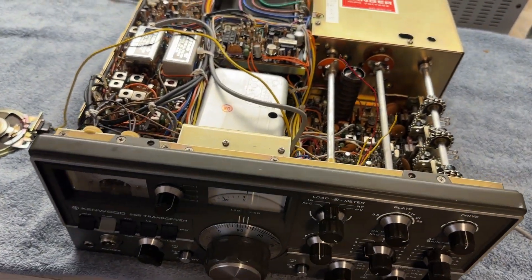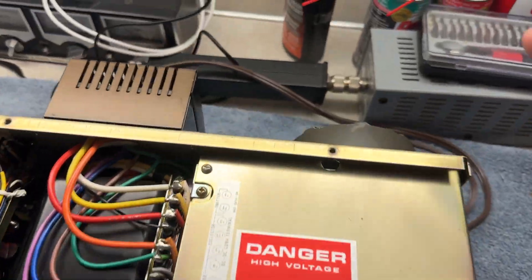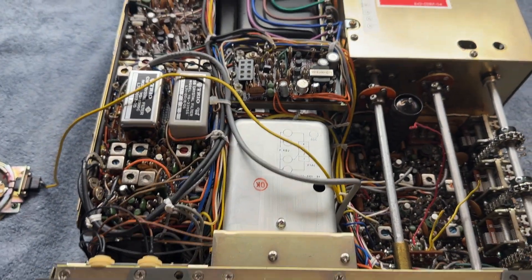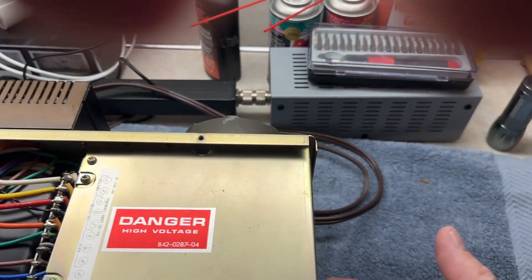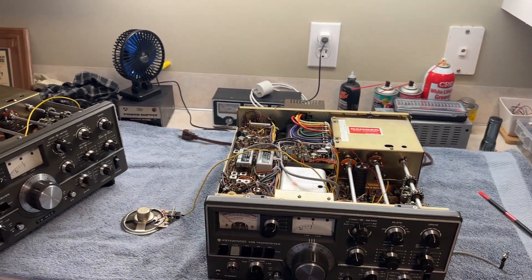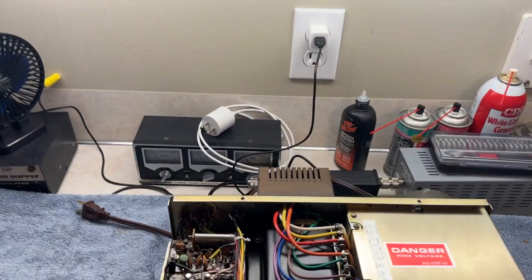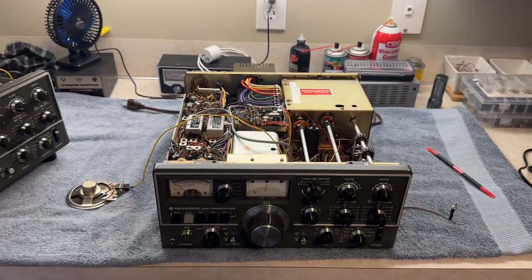Then, having done all that, go ahead and turn this off, unplug it, turn everything off, and pull that wire out. If you're going to test and see if everything's working great, hook your dummy load back up, flip your SG switch up, and you should be good to go. I hope that helps people who were having problems where they just weren't getting a minimum reading when connected to a dummy load. Thanks for watching.